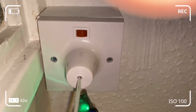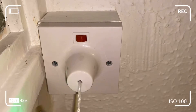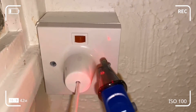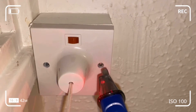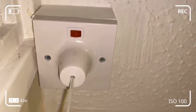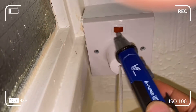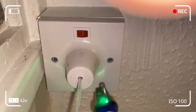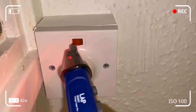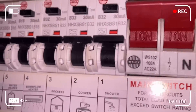I'm confident I've got two live wires in there, and the pen is picking up on the live conductors in the pull cord switch — so it works. Note how I'm testing: I'm not touching the tip of the pen, which could lead to electrocution. Because the pen is quite sensitive, I'm testing from a considerable distance so it doesn't just pick up on everything.